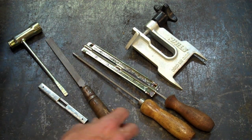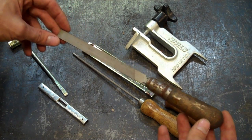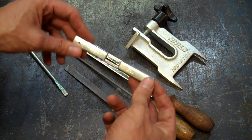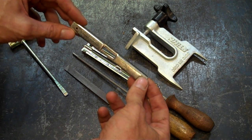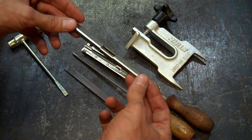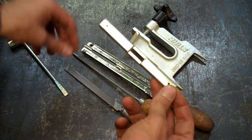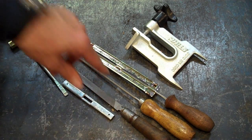The last thing, and most neglected thing, that few people know, this really separates the men from the boys, is a raker file and a raker guide. I'll demonstrate what that is in a little bit. But you can go to Oregon.com, or just type in Oregon Chainsaw, and in their saw maintenance section they'll have accessories, and this is called a raker guide. And it's only a couple dollars. You can get a combo raker guide with a raker file, and I'll demonstrate that.